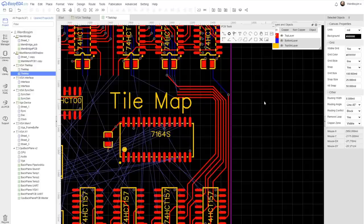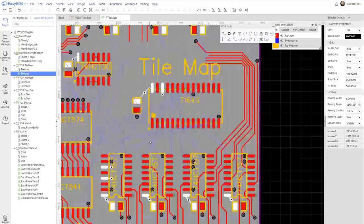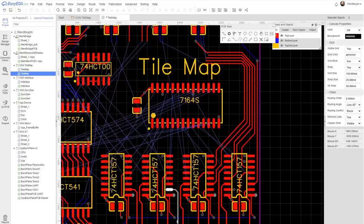Okay, so I'm trying to tidy up these peripheral lines and then worry about all these core addresses and a couple of the extra signals. So these are basically the counters for the true X and Y position coming down. They go into the multiplexers to drive the address lines when we're not driving it directly from the address bus.